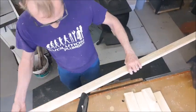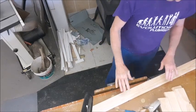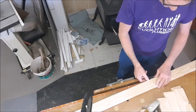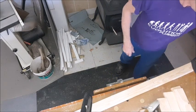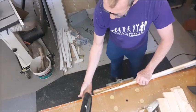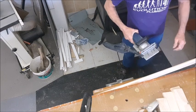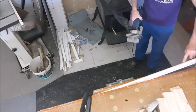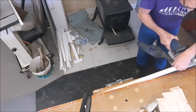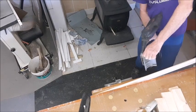The next one is the other piece with the bull nose. On this one, the objective is to have that bullnose sitting outside of the ply. I'm going to set the joiner here again so that the crease line I get making the bullnose is sitting perfect with my marking. As long as they're all the same, that's all that matters.